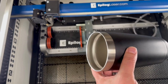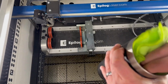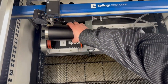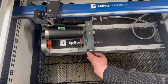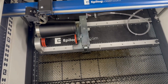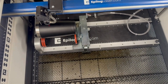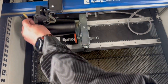I'm ready to put this on the rotary attachment. To make sure it rotates evenly I like to add a little weight, so I add a couple of large batteries. Then I put a little rag in there to make sure the batteries don't slide out, because the lid for this mug is not even and would stop it from rotating. Next I need to level the piece, so I'll put my level on here and raise it up until it's level. Finally, I need to focus it — I'll jog over a bit, put on my focus gauge, and raise the table until it's just touching, so I know I'm in focus.